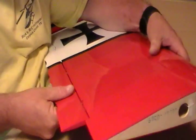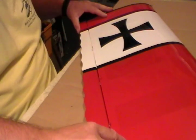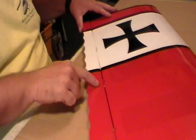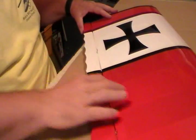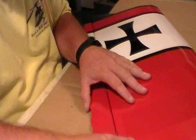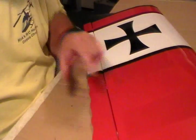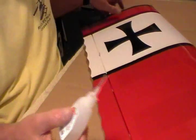You don't want that binding or touching on either end, so make sure you've got good clearance. Be sure they're pushed in all the way to the pins. Sometimes you'll get a little spring on one end — if you do, just do that hinge first, go down a couple, and then push the other end in. Once you get that seated where you're happy with it, we're going to pull these pins out. I've got a little spring on this far end, so I'm going to glue this in first.